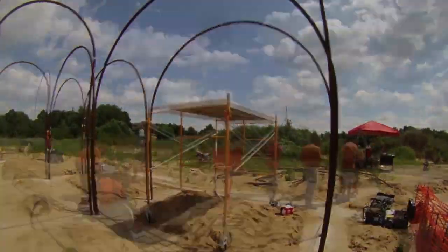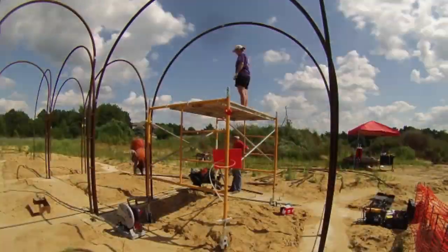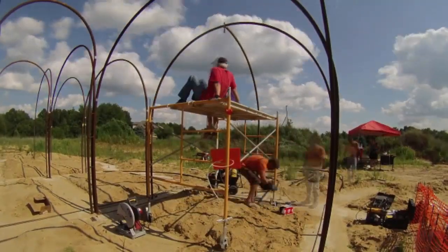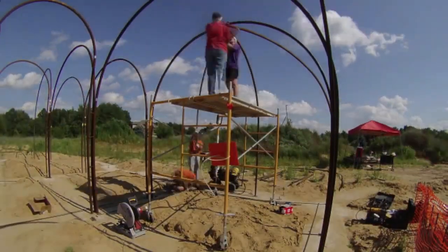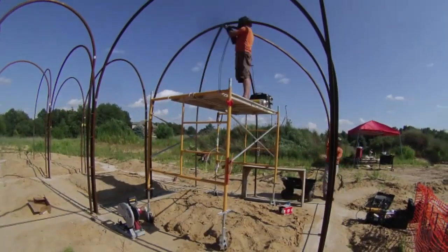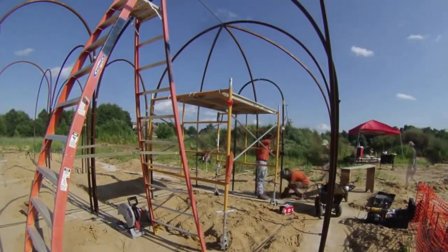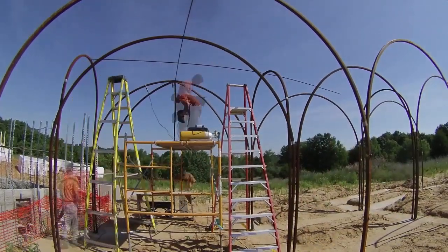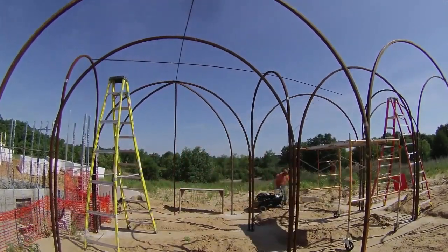The trickier part was getting the miters to fit exactly. These were the ellipse arches that were simply cut in half, so I'd expected to have to trim them to fit the corners anyway, but even more so due to the small adjustments in the layout we had to make. The process was to place them, mark for the trim, then take them down, cut them as needed, and bring them back to weld them into place. This will be a groin vault, so we're welding these rebar pieces to get that right shape and to hold things in place.